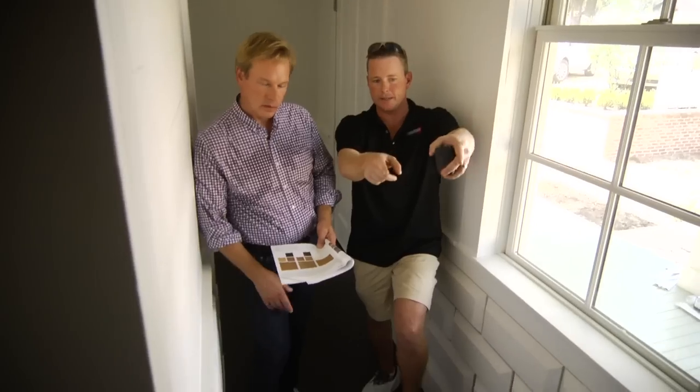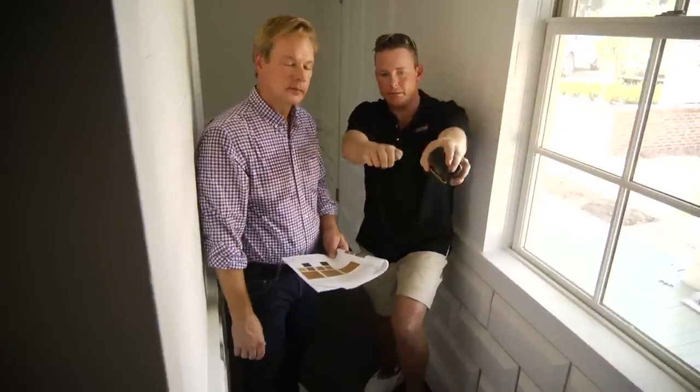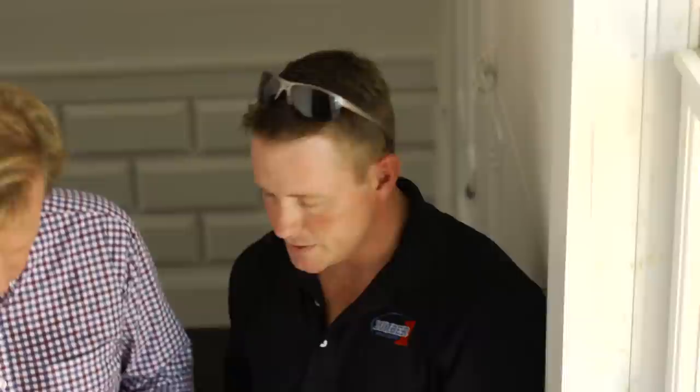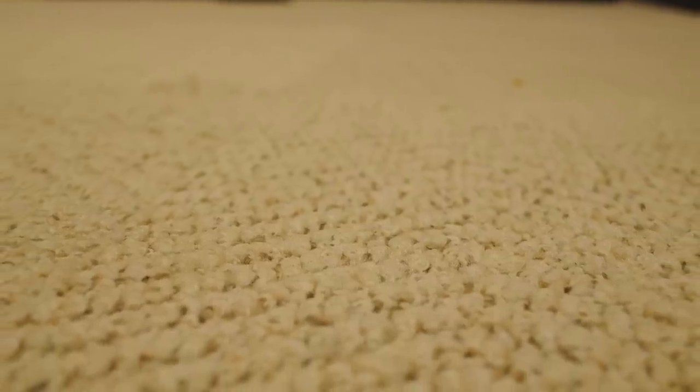Where you are coming up these pie landings, where it has to turn and go up the riser and turn again to come over to the next riser, you don't see any directional issues. So if you've got a 45-degree angle to deal with — as we do, we have two here — then if you want to make it simpler, you ought to go with something that's non-directional but has a pattern.